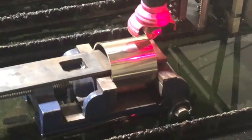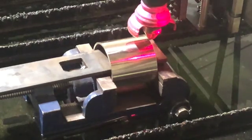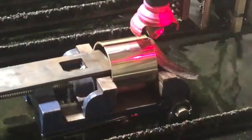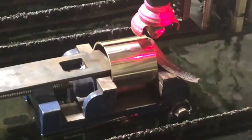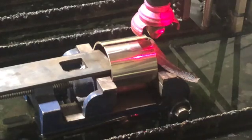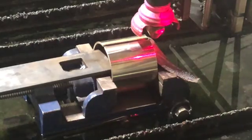We'll do it for real. Note that when you set up without the initial height sensor, you'll get a warning saying you're not using torch height control. That's okay — as long as you've set it to cut at the right height, you're good to go. There's the first cut. Notice how wide the gap has become — that's a lot bigger than the kerf. This tubing is obviously under a little bit of stress, so once you make that cut it opens up. Now all I need to do is turn this thing over, find that same mark on the other side, and repeat the process.